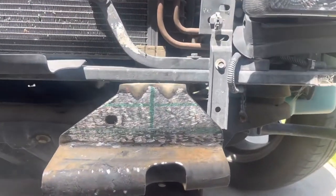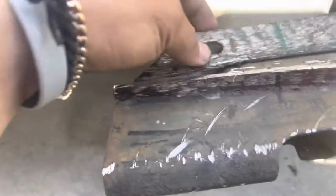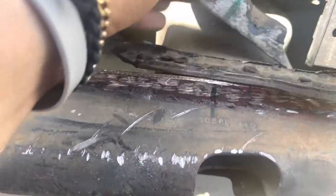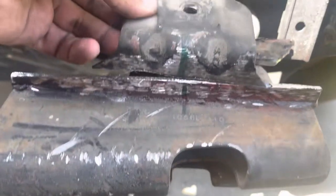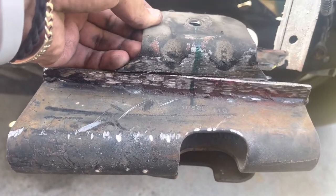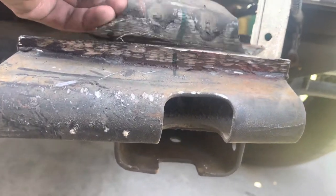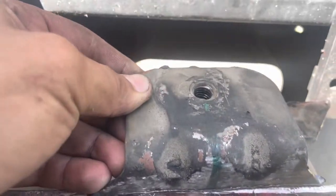Here are the brackets all lined up right before we cut them. We went ahead and cut off the inch and a half from the bracket - this is what we have now. This is why we do the green line, so we're able to line it up. This is what the brackets are going to look like before we weld them - the green line matches up, which ensures the mounting hole is going to be in the same spot.